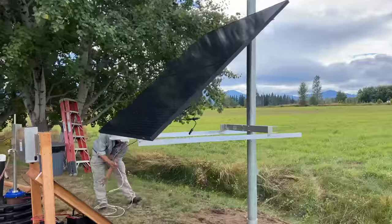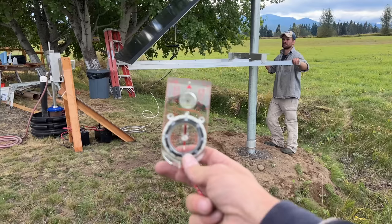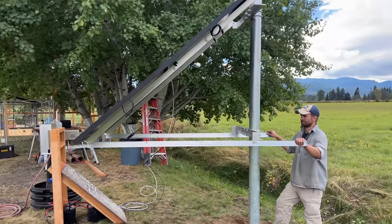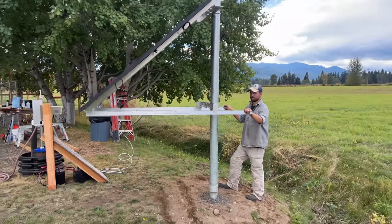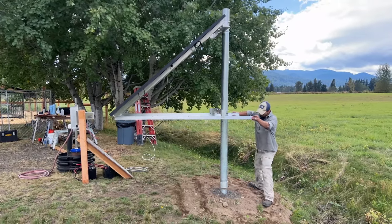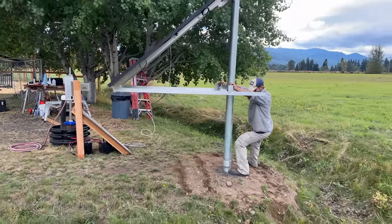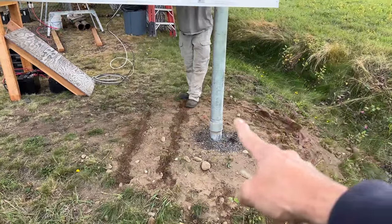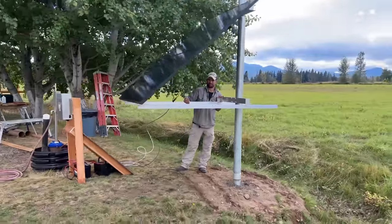Just finished up installing the panels. Now we're going to show how we can rotate this into position. Solar panels, as we know, like to point towards the south. Being pretty close to the 45th parallel here, it's not ideal for solar, but we don't have that much demand. We've got it almost tight — if the two of us get on there, we'll be able to rotate it into position. Once that's done, we will put a spot weld on that to lock it in, because that is a huge sail and the wind will move it around if we don't.